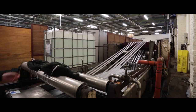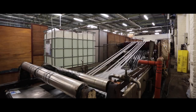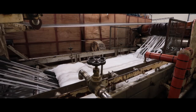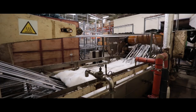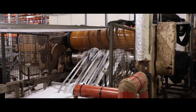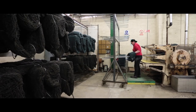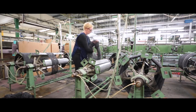There are four different baths; two of the baths are heated up to a certain temperature and 40 litres of soap are added to these baths. The yarn runs through them and is then taken out and put on hangers for drying. The drying process takes 26 hours — 16 hours of drying and 10 hours of cooling.